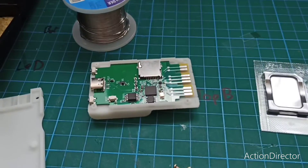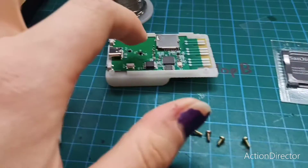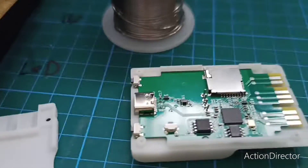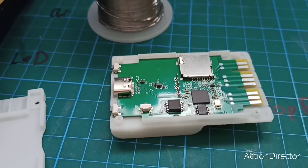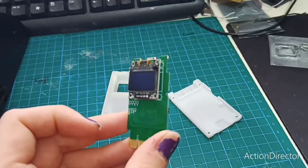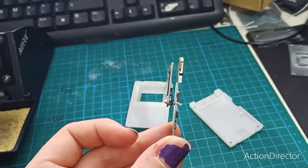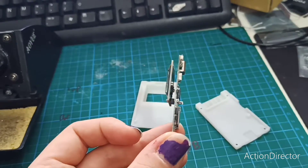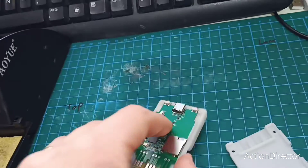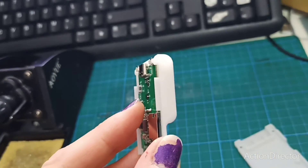Here it is with the motherboard placed in place with the screen underneath it. You have to be careful to make sure it's seated correctly because you have to solder those pins while it's in place. This is why you have to solder it in place while it's sitting in place — because it doesn't sit flush to the board. It sits just far enough away that the pins are a set distance, and if you don't solder it in place, the screen won't be in the right place when you sit it down into the enclosure.